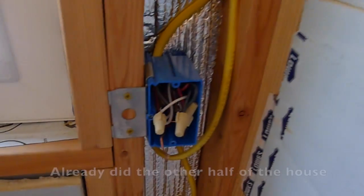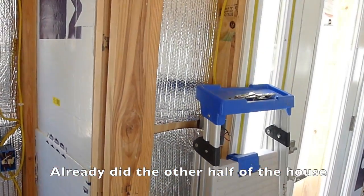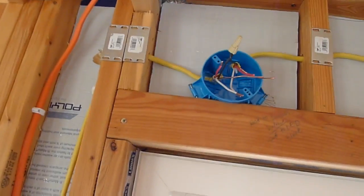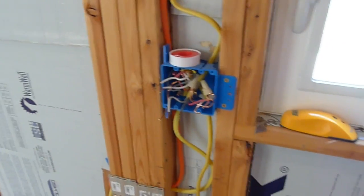I'm to the part of this where I'm getting a bit bored with doing this circuit testing. I've tested this, which is the outlet to the right of where the oven's going to be and the stove. It comes from up there — it's the first outlet in this circuit. I tested it down to there, and I still get continuity. I've tested it up to here to the light, and I still get continuity. This wire comes across the bathroom and over to this light outlet and down into here, and I still get continuity. So this is pretty much as I expected.